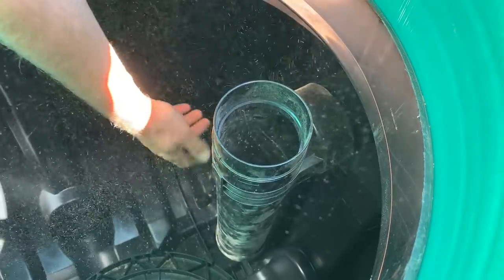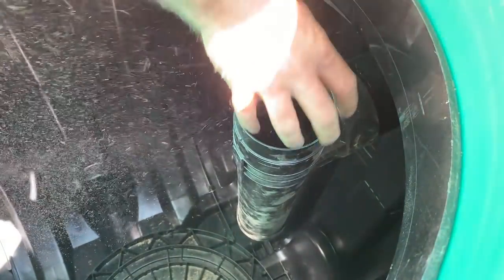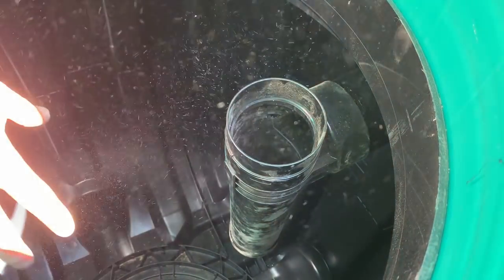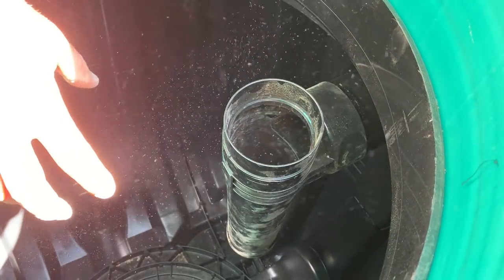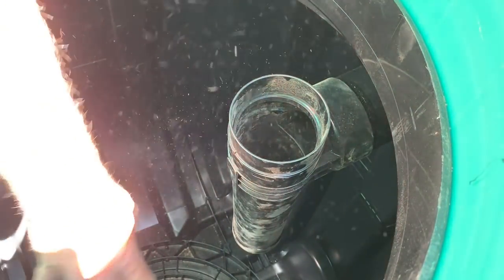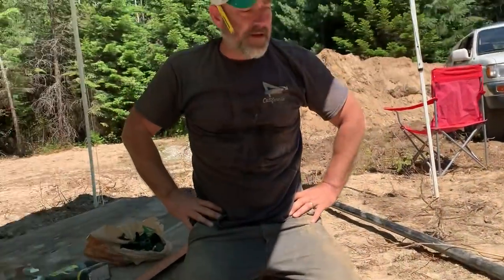It's on - hands pointing down. Yeah, that's awesome. So he said you want this cleanout just big enough that if you have a problem you can take the lid off and push it down, in case you have a clog. You don't want it out here in the middle because later when you have your septic tank cleaned out, they've got to get a hose down in there. Put it over to the side. Looks beautiful.